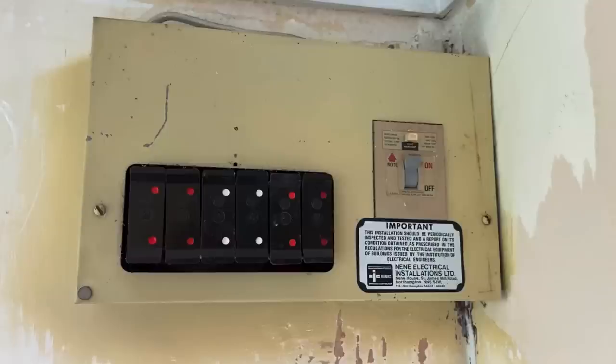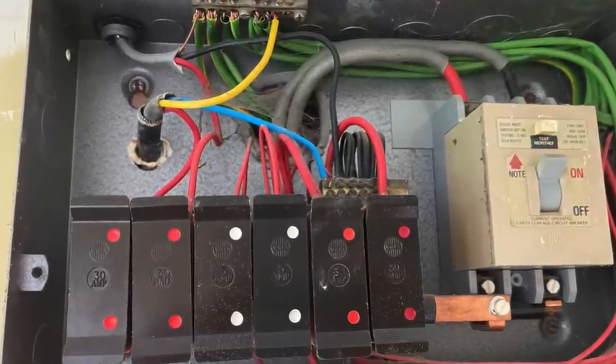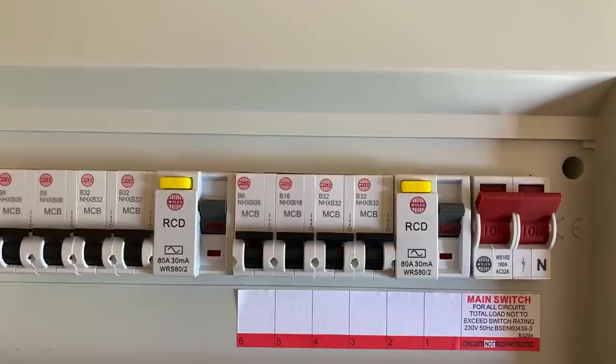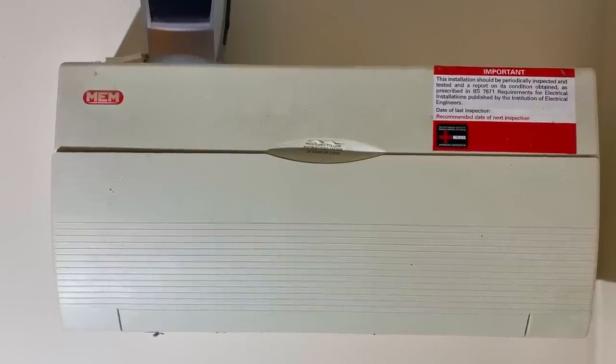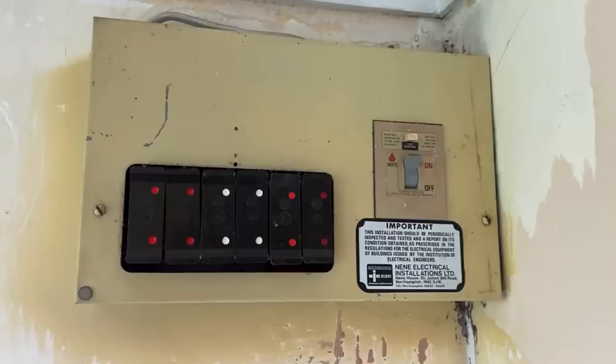Is the customer going to select exactly the right size fuse wire? Working from right to left we go red, red - so 30, 30 - and then five, five, 30, 30. Are they going to select the exact size fuse wire to replace, say, the 30 or the five? Or if all they've got is 30 amp rewireable fuse wire and they put it into the lighting circuit, they create a dangerous situation with it being overfused for its conductor sizes - maybe one millimetre squared. So there are issues there that need to be addressed. It doesn't always mean that an older consumer unit necessarily needs to be upgraded - there are lots of other considerations before you decide to change a consumer unit, not just that it's made of plastic.